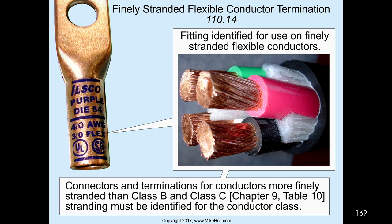Brian: Well, I was actually trying to look up the exact terminology for it real quick, but there's also another method that's very common, and in fact, Camlock connectors all come with a little square of, I think it's brass or copper foil, and you just wrap that around, and then it's got a little wire, and it's got instructions that you twist it to hold it in place, and it's thick enough that it does the same thing. But it doesn't have to be listed, it just has to be identified, and it's identified just for that purpose, to keep the conductor from expanding. Okay.